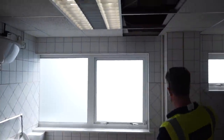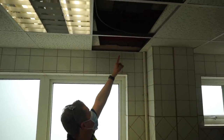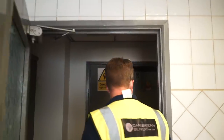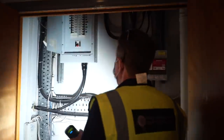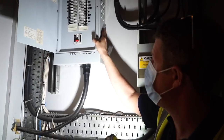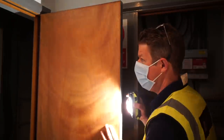Inside, we've opened up the suspended ceiling. The wall where we're running the cable tray is on the other side of where the planter was. We'll run cable tray on the ceiling, hop over a steel beam, run it all the way along towards the distribution board. We drill through this wall as well, run through the ceiling section, and the distribution board is right there — very handy. It's an old board for heating circuits no longer in use, so we're going to repurpose it and install four new circuits.